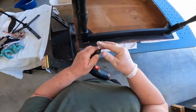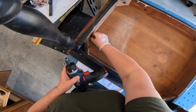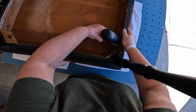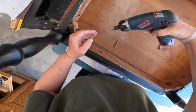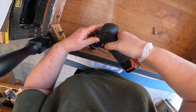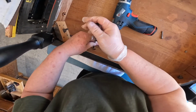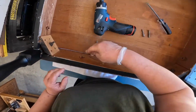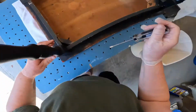So I did. When I brought it home, I realized that it was difficult to take off the base because the way it was put on, some of the supports for the legs were covering the screw holes. I had to get a crowbar to take this off once I released most of the screws, and then later on I'm going to screw in the supports and not use nails. On some of these supports, there were about 9 nails that I had to take off, but I glued the pieces back together because they started to disintegrate, and I used all the pieces to put it back together. So you'll see at the end how lovely it looks.